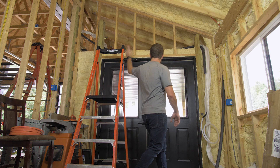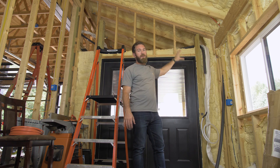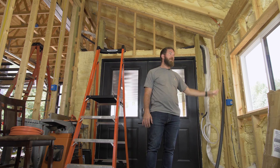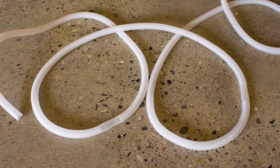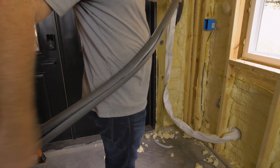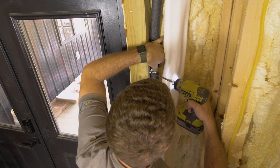The nice thing is that we were able to install it in an interior room and keep all of that line stored in our dead space, run it down this wall, and bring the line out right at where the compressor is going to be set. You've got these pre-charged lines, and you've also got a drain line that we have to route outside as well. Since the majority of that drain line is going to be inside, we're going to wrap some insulation around it to make sure that it doesn't sweat over time.